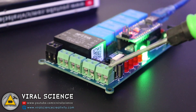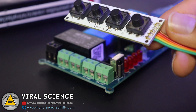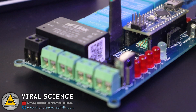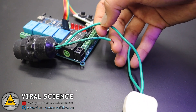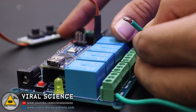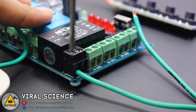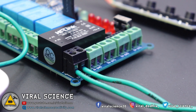On the PCB you can connect your buttons on these four pins. I also have a PCB for this, so I will directly connect the four button pins to our PCB header pin. Now we'll connect a bulb holder to our PCB board — cut one of its wires and connect it to the terminal connector, as shown. Be very careful while doing this as we are using high voltage. In this new PCB design I have provided a 220V AC to 5V DC HiLink converter, so we don't need any extra 5V adapter and can power this circuit directly from a 220V AC socket.